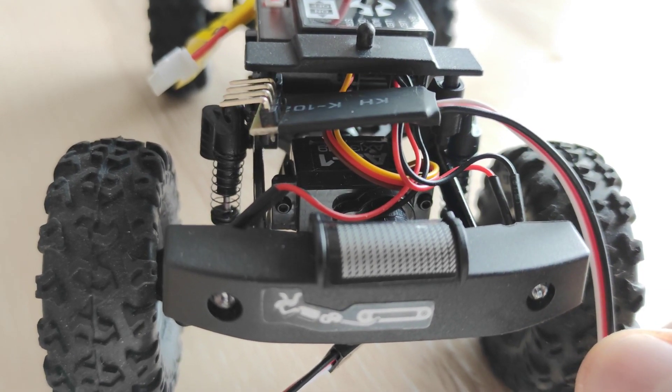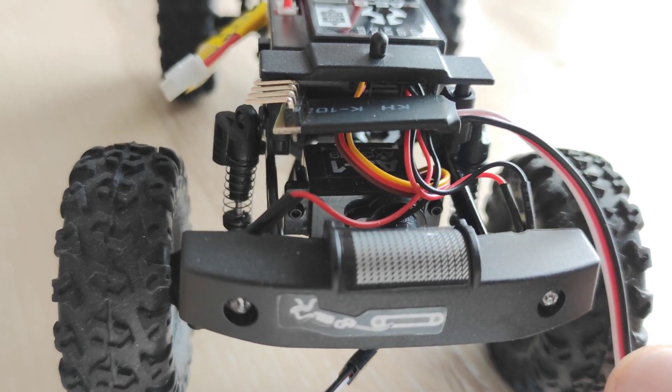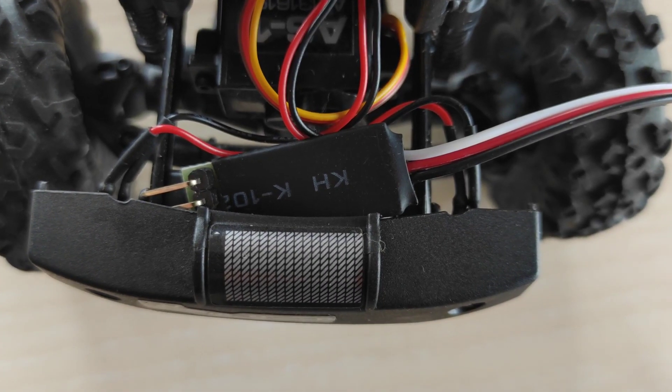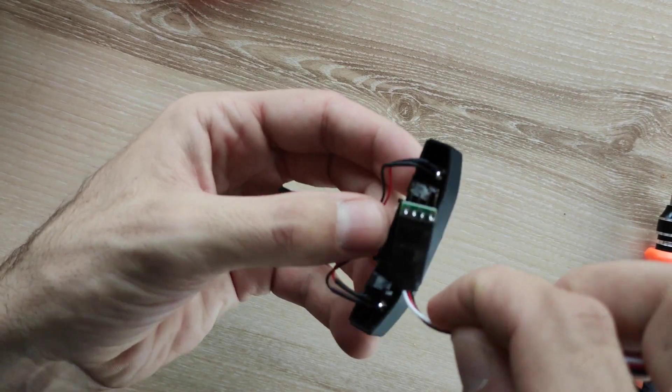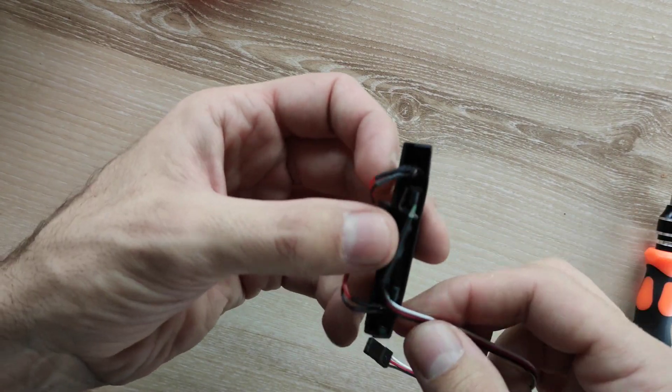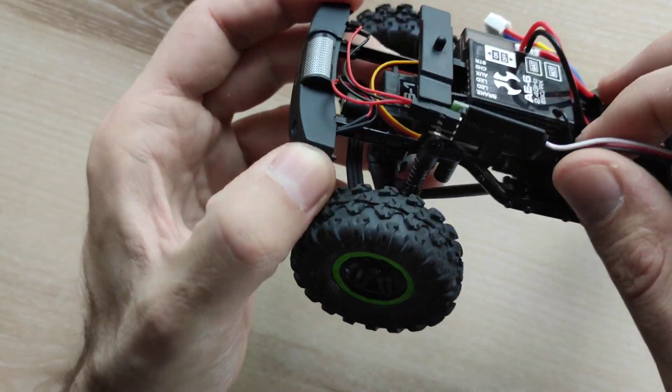I tried to attach the controller under the body mounting point, but I was afraid it would wrap against the plugs. A second attempt was to mount it inside the bumper, and I think it would be possible, but a little bit tricky. Finally, I decided to resolder a few joints and attach the board to the side of the ESC.